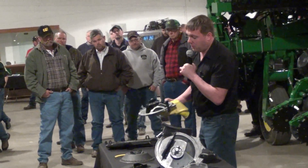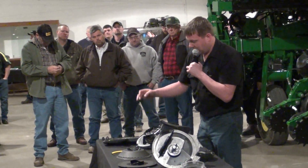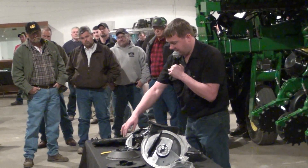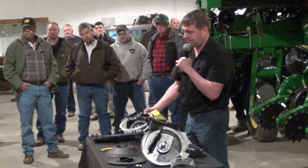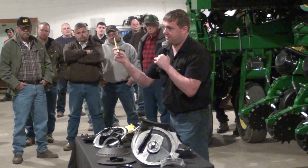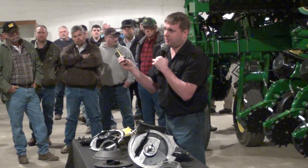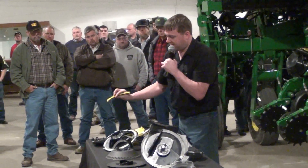With the disc or bolt riding tight against the housing, they've got four wear pads on here. When they get down to where you start to see a little rubbing on the housing, they want them replaced. If two are not wearing but two others are, you can actually swap them and move them around to get a little bit more wear out of them. When switching from corn to soybeans, this is a corn agitation strip. The old black ones last about 2,500 acres and then need replacing. The yellow ones are supposed to last longer, but they snap in and out really easy.